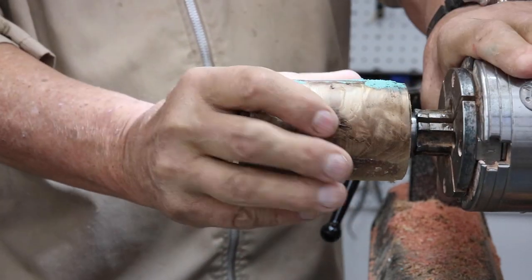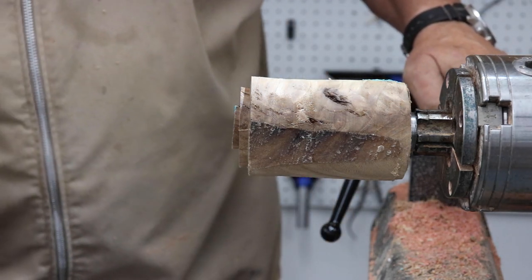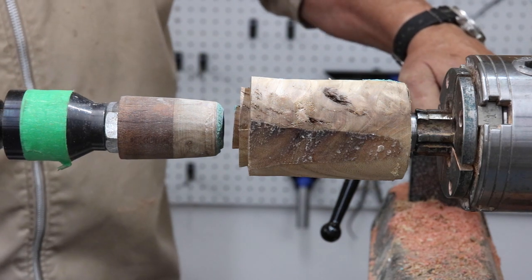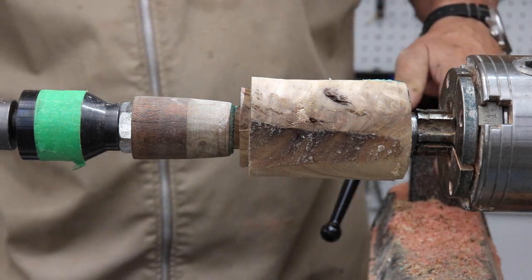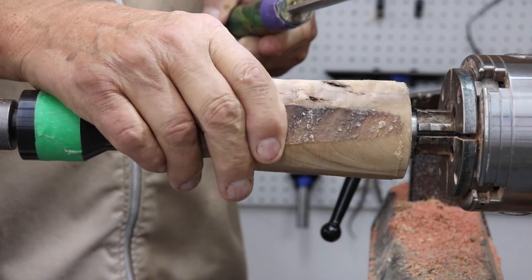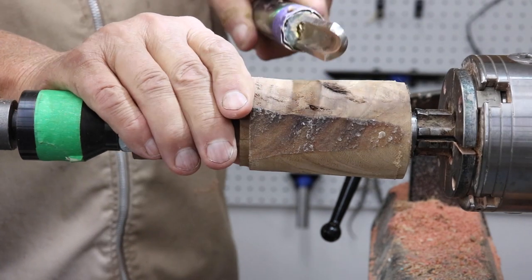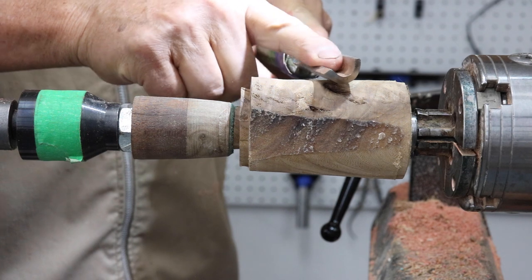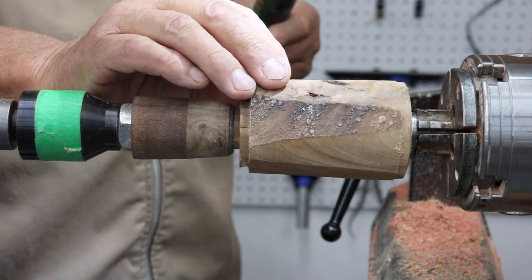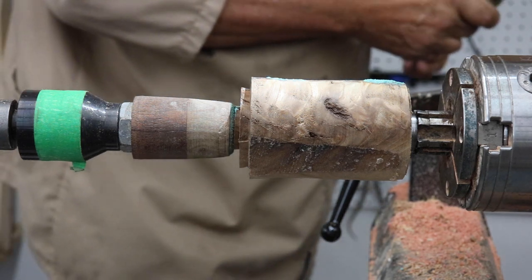This is the area that will be the handle, and I need to keep in mind that this is probably more for my wife's hand than mine. I'll bring my tail center up for some support. Ordinarily I would use a spindle roughing gouge on a project like this, but there's a lot of really convoluted grain going on here and I'd probably end up running into some end grain with this tool — it's not for end grain, it's for side grain only. This is really not a true spindle turning, so I'm going to find a gouge and use that to begin with.